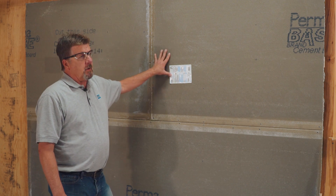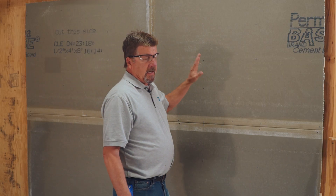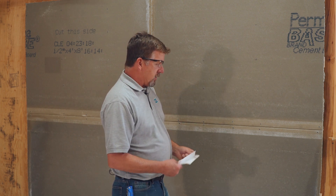When we have the cement backer board installed on the job site, we want to make sure all the stickers are removed off the job site. Don't leave those up because it can be a bond breaker with the stone in that area and the other products being used.